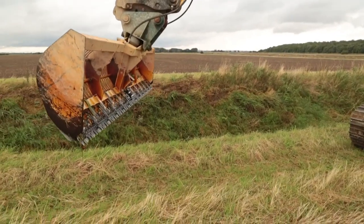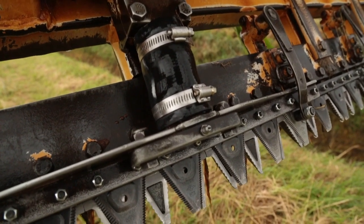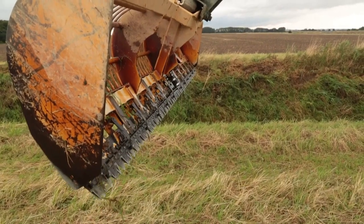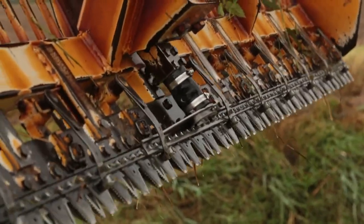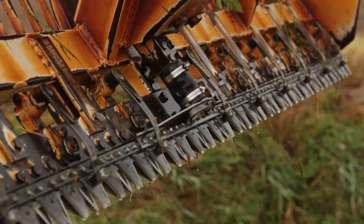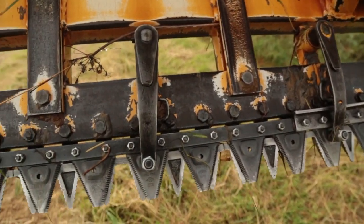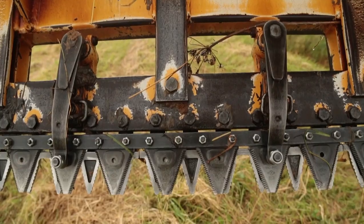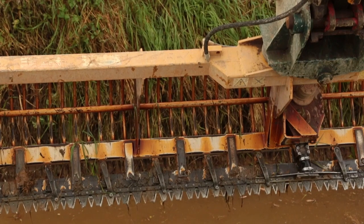There's a grease drive near the rubber cover with the two circlips around it, and a drive pin that runs into a bearing. About six or seven pumps of grease into it every day - just keep it well greased and that's basically all the maintenance there is on there. Your wear plates on your drive arms are more or less the same thing. Just keep on top of maintenance - have a look around in the morning, make sure everything's close and tight and pressure on the arms is alright. There are self-maintained pressure on them. The cams just wear out as any moving part does - replace as and when necessary.